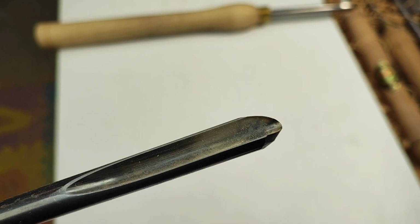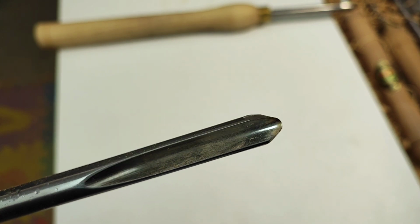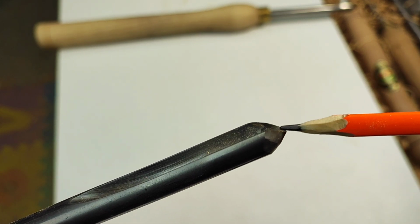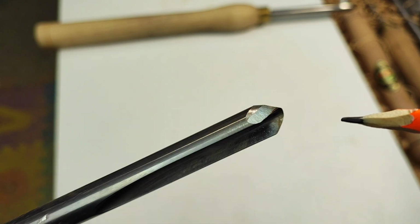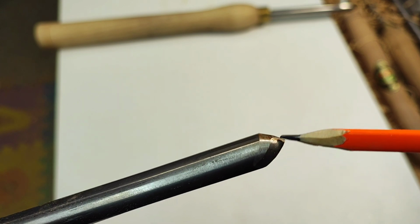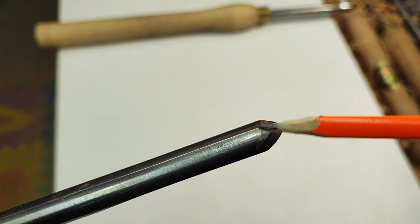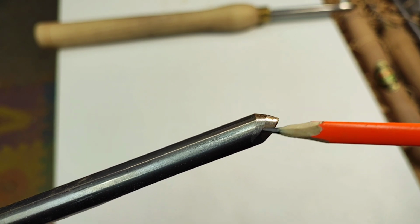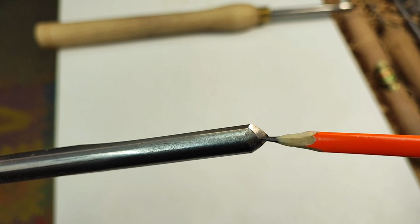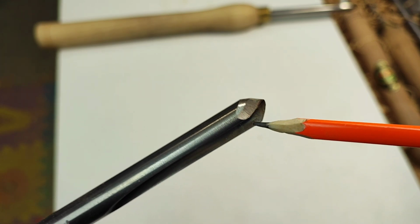This is an asymmetric grind, but this one is done on a platform instead of on the edge of the platform or in my hand that I generally do. So what I want in a gouge is a nice curve here on the wing, and this one isn't so much. You can see it's a slight curve for hollowing. And also because my wheel is now quite reduced in size, I remove a lot of the bevel, so almost half of it, sometimes even more, and I do that all the way around. So I'm left with 2-3 mil of the bevel, primary bevel, which is in use.